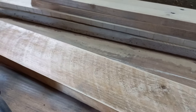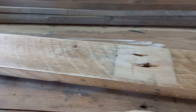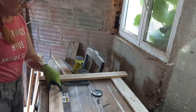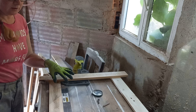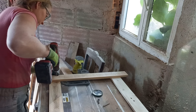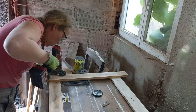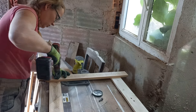I don't think I'm going to use this one on the face of this piece. I'm going to go back to using the regular sanding attachment with 80 grit, because this is a little more flat to start with, so it will be less work to clean up if I don't add more scratches than necessary. Now that we've cleaned up our reclaimed lumber and squared up the edges with everything cut to the lengths I need, I'm using a corner square in place of a square clamp. So now we're going to pre-drill and countersink, and then attach the other leg.